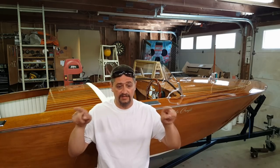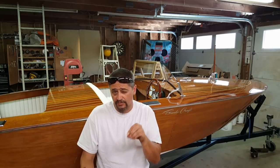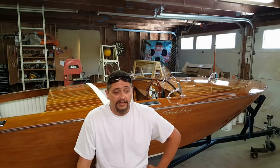I would build my transom for a long shaft or a 20 inch shaft. Currently where my outboard sits, it is cut out. And that sets the height of the outboard so that your cavitation plate is dead flush or slightly above the bottom of the boat. So I built my transom in the classic style. You know, I love the look of it, I do. For a 15 inch leg or 15 inch shaft outboard, short shaft.